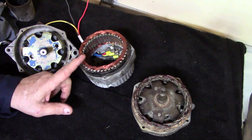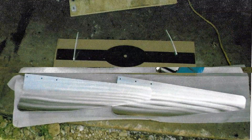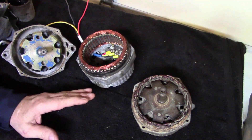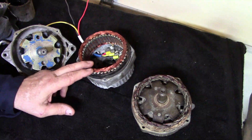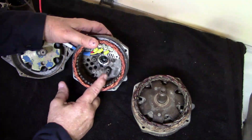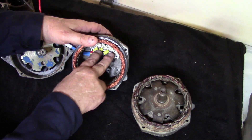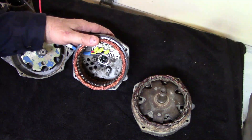I had bought a kit — a different set of windings and a permanent magnet armature, and that's why they call these PMA: permanent magnet alternators. The windings are much finer. No brushes, no capacitor, anything like that. The only reason the bridge rectifier is still in there is so I'll have a terminal block that I can come off with the AC voltage.